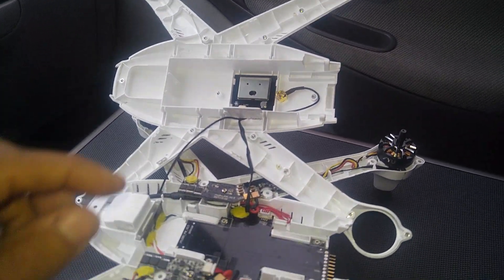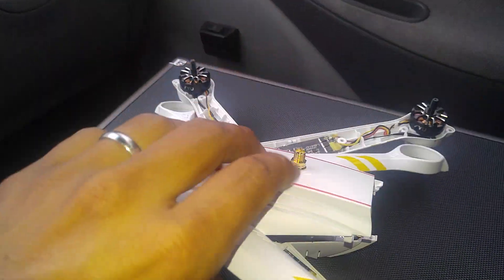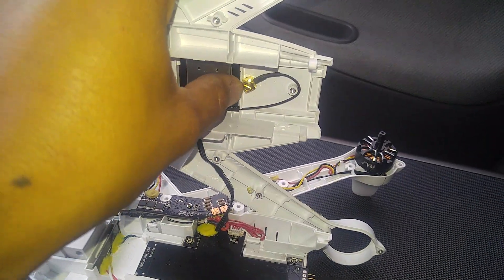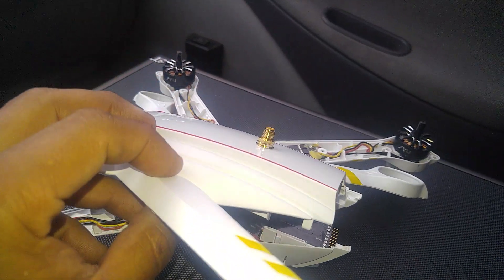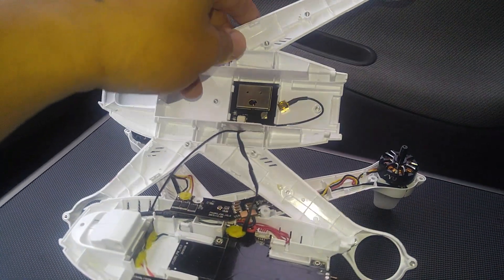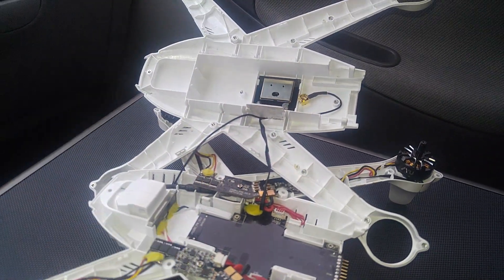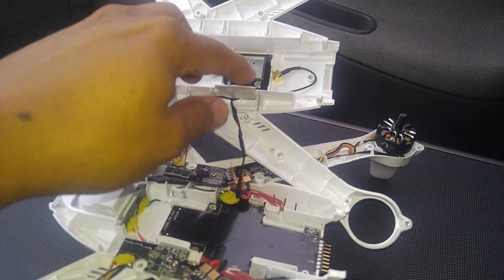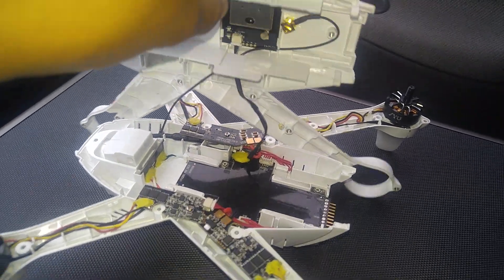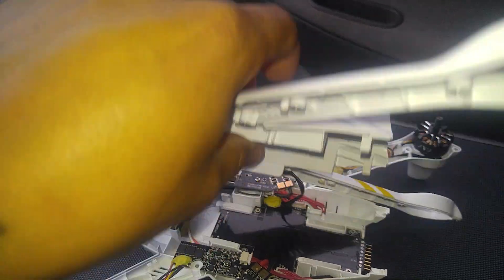The reason I did it this way is because this is the only spot where the cable fit — my SMA connector will fit. It's a 90-degree SMA connector. You can use female or male, whatever you want. This was the only spot I found space for it. I wanted the antenna to be on the center top like regular racing quadcopters, so you drill a hole to the top part for this thing to pop out.